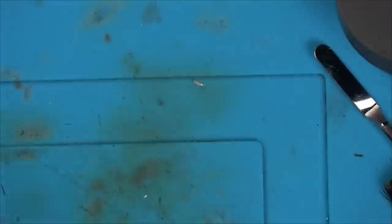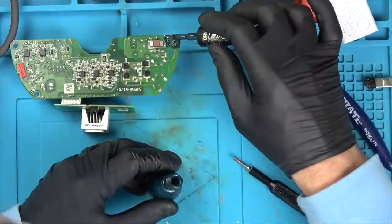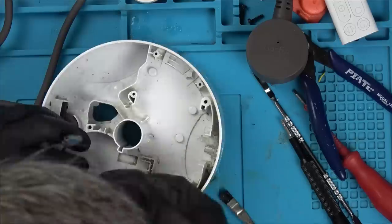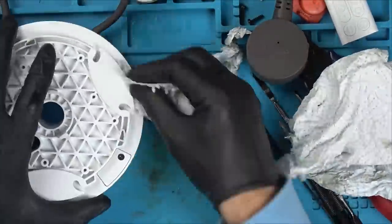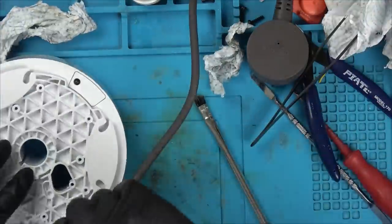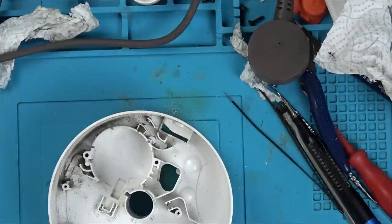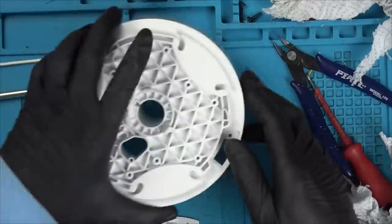I wouldn't have a fan on when the property is vacant anyway — it would only be when somebody's in the house. I can't see there being a problem with this because the char has now gone from the board. I've repaired the little contacts coming in to give them a bit more mechanical strength. I've run a little jumper wire between the prong that was burnt and the good prong on both live and neutral, and I've completely got rid of all the char with the Dremel tool — so we're back to clean plastic again. I can't see why this would not be okay to use. The fault was some sort of liquid damage which I think I know the cause of — I'll show you that next.